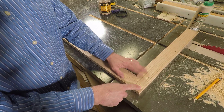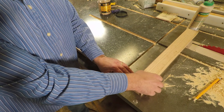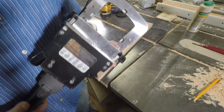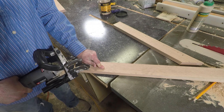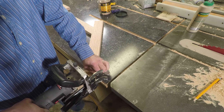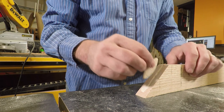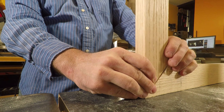Basically, a glue joint like this would not be very strong by itself, so by cutting a slot in each side and gluing in a biscuit like this on both sides, it helps increase the strength of that joint exponentially. Biscuit joiners are pretty straightforward — I place this against the piece where I need to cut a slot, I'll line the red line up to the mark that I've made on the board, and when I press the button to turn on the saw and push it in, a blade pops out from the end and cuts a slot into the workpiece. Now with the slots cut in both pieces, I'll apply glue inside of both slots. The biscuit gets pretty well covered in glue on both sides, and the biscuit actually absorbs some of the glue and swells a tiny bit, making the joint that much tighter.